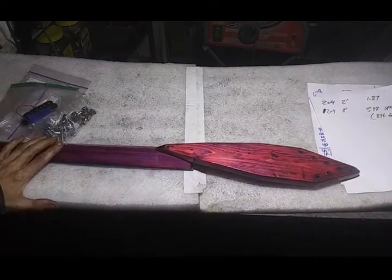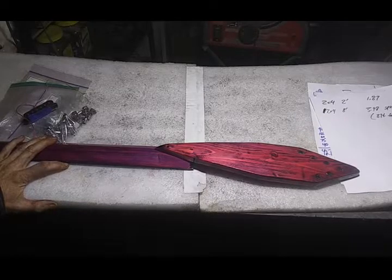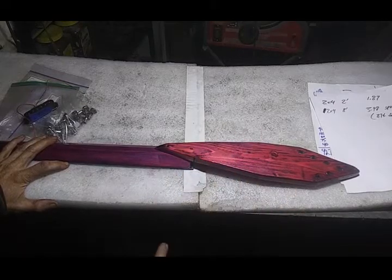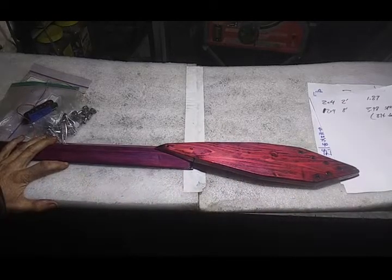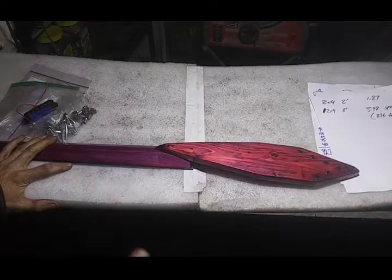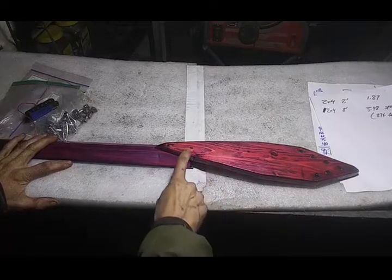If you did like a Cedarwood dye, a yellow and a red mix orange. And so if you did this technique using yellow and red, so you put down the red first, sanded it back, and then hit it with yellow, you'd end up with a dark reddish orange for the dark part, and it would be almost yellow